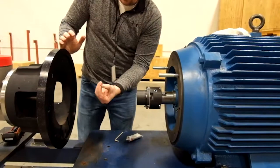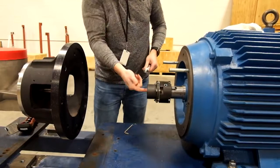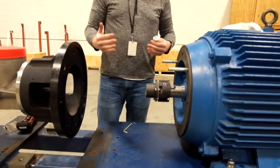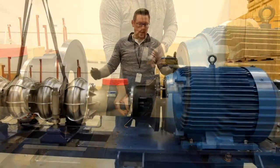After that, I install the drive key onto the pump shaft and apply anti-seize on the inside of the coupling. Once that's set, we move on to bringing the pump back in. Since our alignment is already set, we put it back on the guide pins, slide it in, and then start to install the motor adapter bolts.